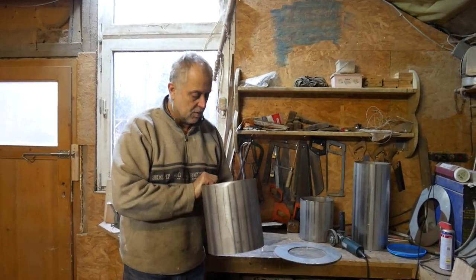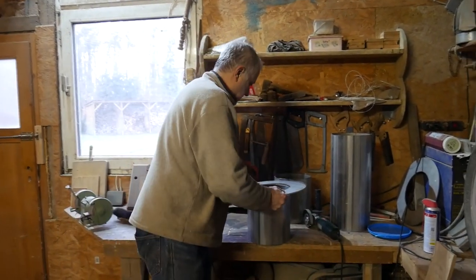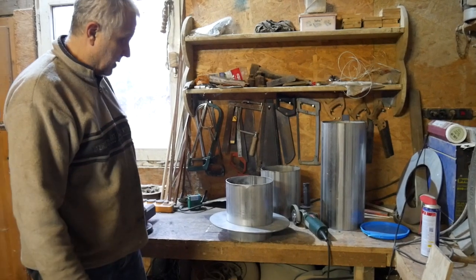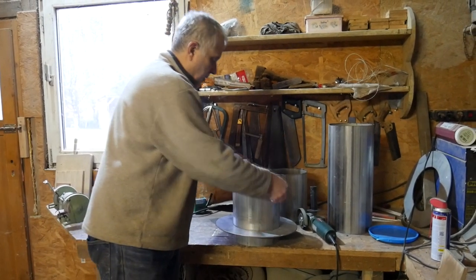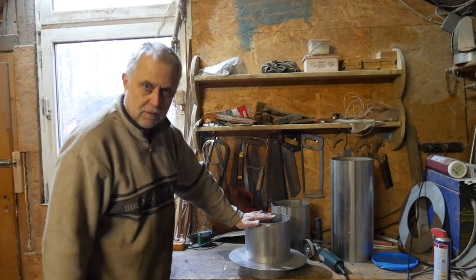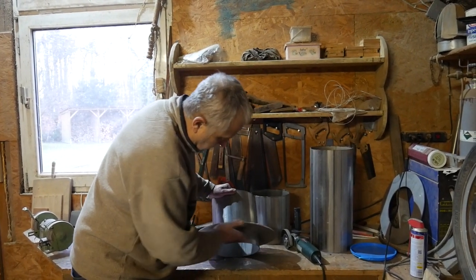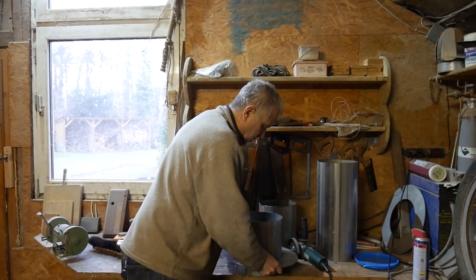I bought this stainless tube to make the partners fittings, and these discs are laser cut discs. I'm cutting it to length and it pops in there and comes down somewhere like that. You need to get the angle right for the foreneck and the mast angle, obviously weld that up. Put some plates up there for fixing blocks and supporting it all, and a lip around here so the mast boot comes over and locates onto that. It'll be a very tidy partners fitting. I've cut it deliberately a bit too long because I need to get the angle for the deck — I don't want it protruding through square in the forepeak, I want it level with the deck. So I'll trim it off at the angle of the deck, but it's a start and it's going to work nicely — a pretty solid partners fitting.